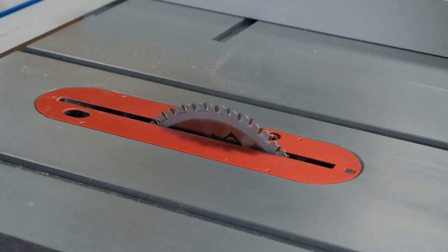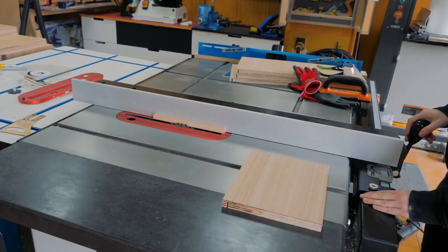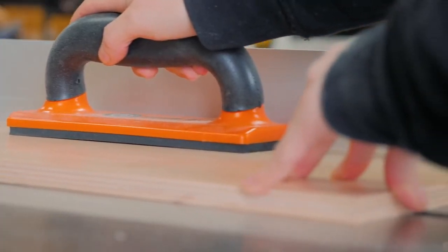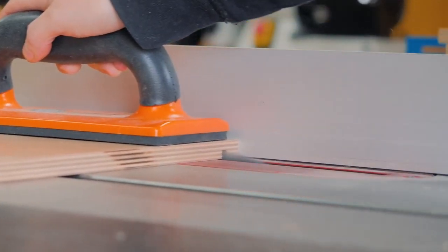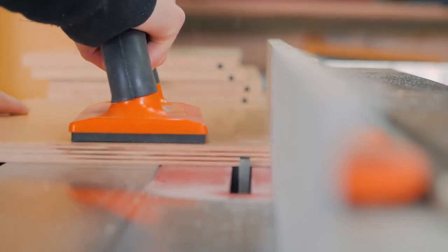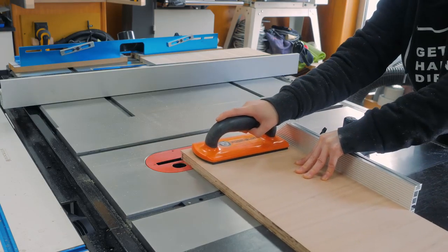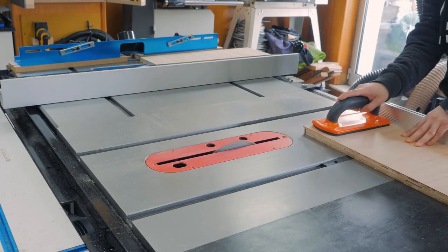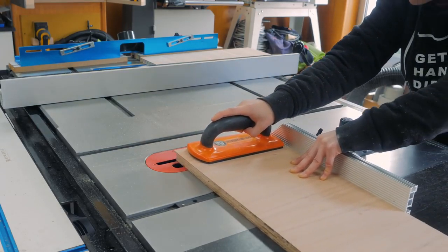I set the blades for a 1/4 inch cut and first cut all the grooves on all pieces to receive the bottom boards. Well, I know what you're thinking. Yes, I am in Europe, and yes, I have a dado blade set that I found with the 20mm arbor hole, and yes, my table saw has a long arbor to receive thicker blade configurations, and yes, this table saw meets all regulations regarding motor power, stop speed, and brake for dado blade usage.